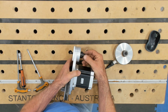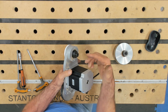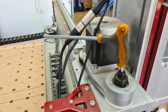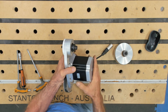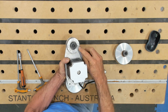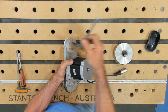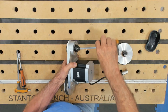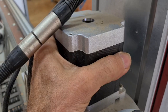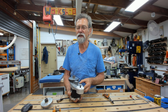This bolt connects the whole assembly to the gantry, either above the gantry or beside it. So this is the X, Y, or slave in my particular situation. You need to undo this — it's just a matter of a hex screwdriver in there. Undo it, hold onto this, and it will come off. Disconnect the cable first. From here on in, it's pretty easy.